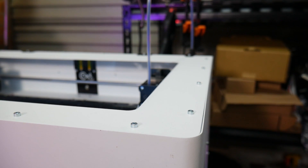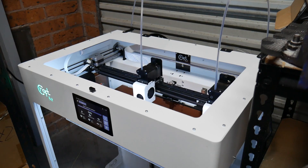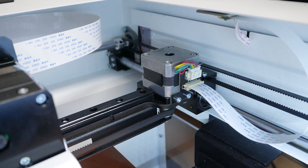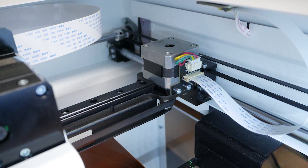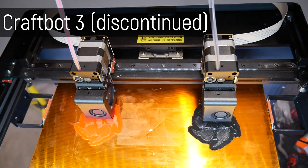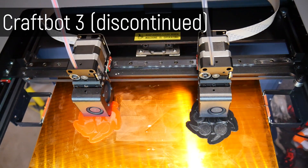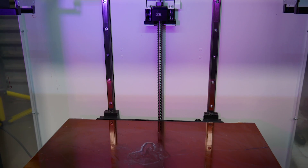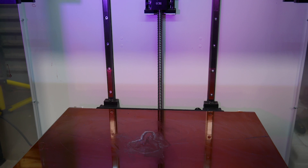Construction is incredibly robust, with the chassis being made from sheet metal and heavy duty motion components. I'm not sure why they only went with linear rods for Y when X has far superior linear rails. This is a step back from the previous gen IDEX CraftBot 3, but at least it has rails and a nice big ball screw for that huge cantilevered Z axis.